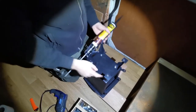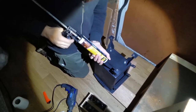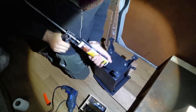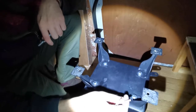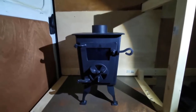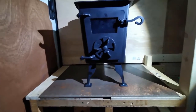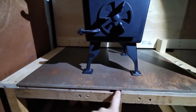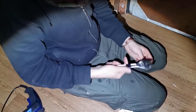We've got this fire sealant rated to 1200 degrees Celsius — there's no way these feet are going to get to that temperature, but it's just what we've got, and we're using it to dampen vibrations a little bit. I'm just piping a bit on and squishing it around to spread it on the feet. It's going to look stunning — it's a great little stove. It was around £130 without the flue kit, but we wanted one with glass so we could see the fire. Really happy with that. It looks like it's in the middle — I measured it about a million times. It's going to look excellent. We'll bolt this down and then probably call it a night. After about a week we'll just check and make sure those nuts aren't coming loose from the vibrations, but I don't want to put Loctite on it in case we need to get the log burner off.